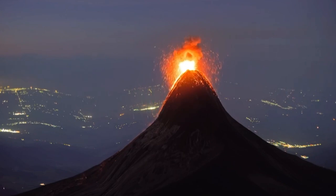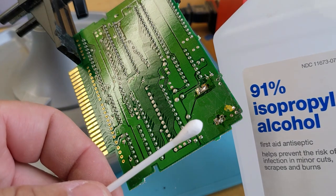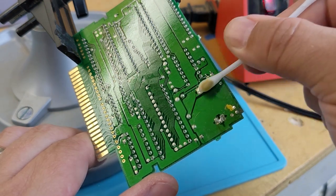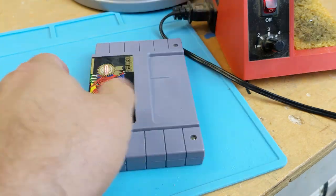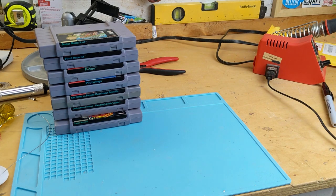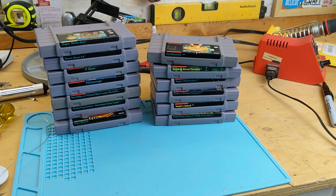This should be a relatively fast process so as not to heat up the board components and battery unnecessarily. When you're all finished with the soldering process, it's never a bad idea to clean up the area with a cotton swab and some alcohol to help prevent corrosion. You might even consider cleaning up the game's contacts on the cart if they look a bit dirty. Then button the cartridge back up and you're done — though I still have a couple of games with important data, like a Mario Paint masterpiece, a Mario Kart time trial ghost, or Perfect Dark profile saves from over 20 years ago.